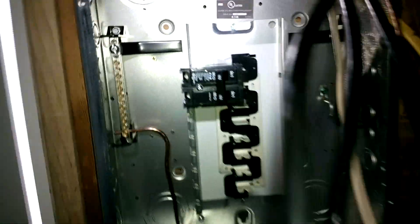We've got three wires here — two are hot and one is neutral. I've got a little tester with two connectors: positive and negative. I'll put the negative on the grounding wire and tap the positive to each bare copper end. The two that light up are the two hot wires I'll put into the breaker. Remember to identify the hot wires first, then turn your main breaker off again before you try to put them in. I've already got a ground wire here.